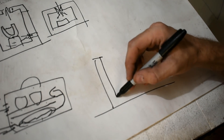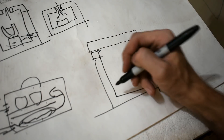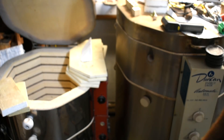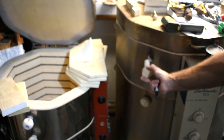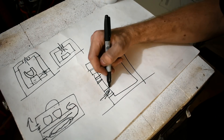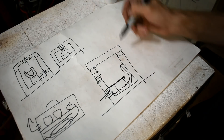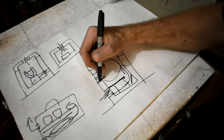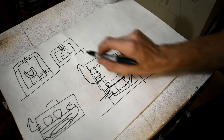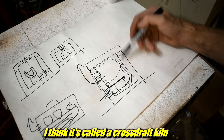So here I have the bottom part of the kiln. I actually have an extra ring and then a lid. There's already a hole here and a hole up here — these are like peep holes, basically something you can open up and take a peek in there, and they have little plugs. I'm going to enlarge the holes and shoot the fire in here, put a floor in here with some things holding it up, and get a little diverter brick. So the fire will go in, hit the brick and shoot up. It's also kind of trapped in this area and the heat will go out that hole. It's not quite a downdraft kiln, but it's kind of a combination of the two approaches put into the shape of a kiln.